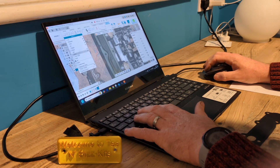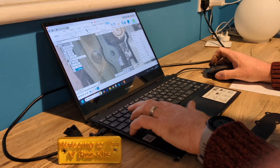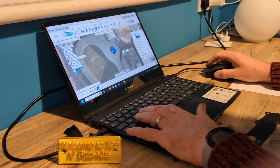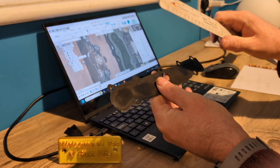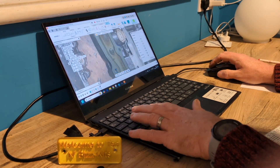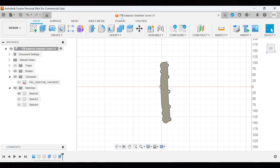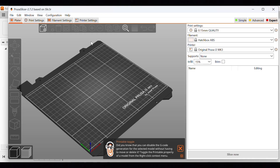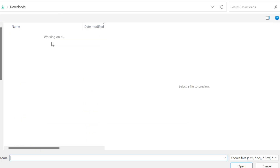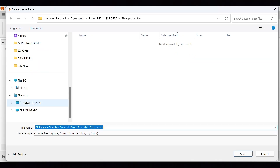Once you've done that, it's just standard CAD stuff. We're going to take that sketch, select it, and extrude it up a couple of millimetres to change a sketch on a profile plane to an actual part. Then we're going to put holes into that part - select the top surface and sketch in the holes. Don't worry about the size of the circles at the moment, just try and make sure they're circular. At the end, dimension one hole - a clearance hole is 5.5mm for us - then make all the sketched circles the same size. Then cut extrude down through the part. Once we've got the part, save it. Open up your slicer program - for me that's Prusa Slicer - drop it onto the bed, select PLA, check your density, and hit print.